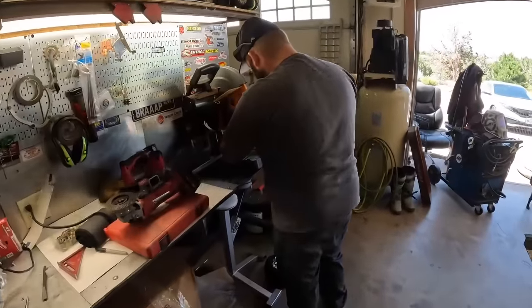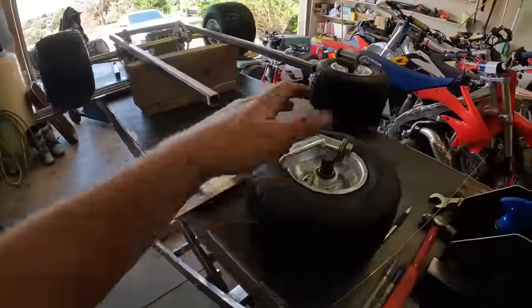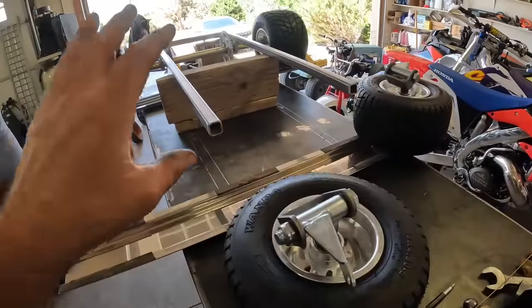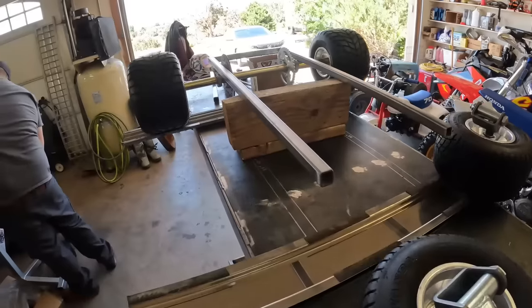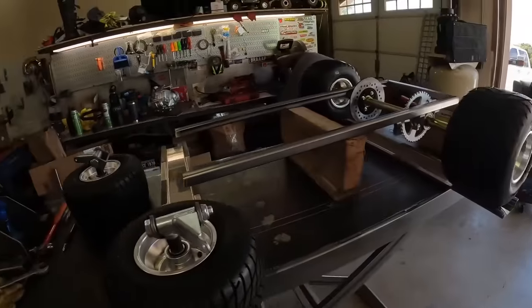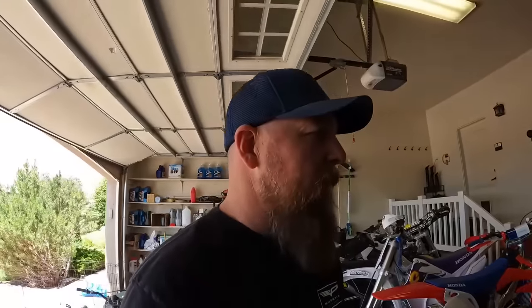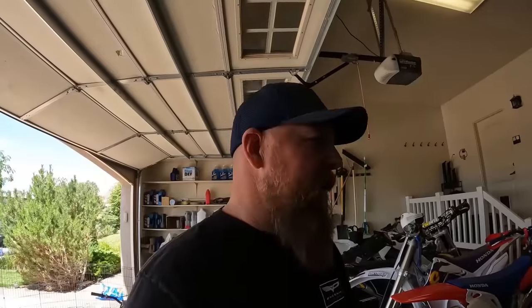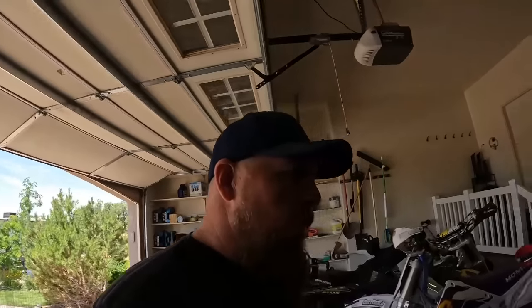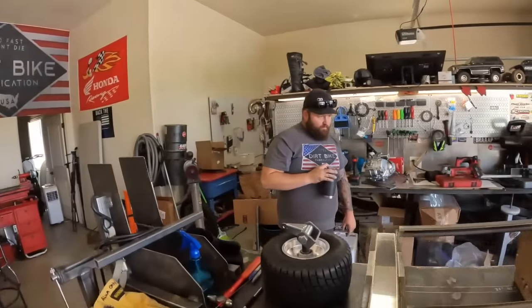He's gonna chop the front axle down, and then we will disassemble these, weld the knuckles to the new axle, and then weld it to the frame. And we'll pretty much have us a roller once we get the rear axle bolted in. So things are starting to come together, but it's taking a little longer because we're doing everything in pairs, because we're building a whole pile of these things, and if we're building them, we might as well do it all at once. Ain't that right, Jedediah?